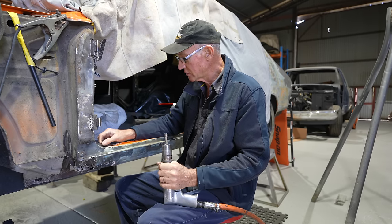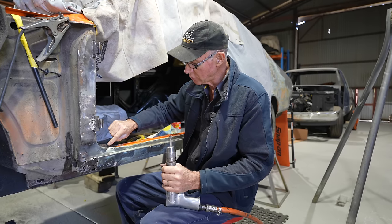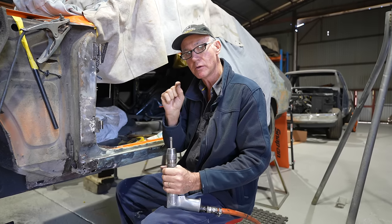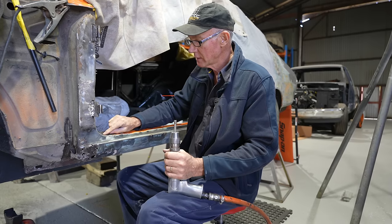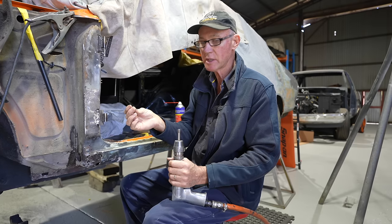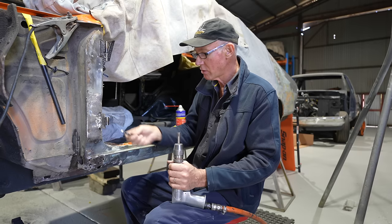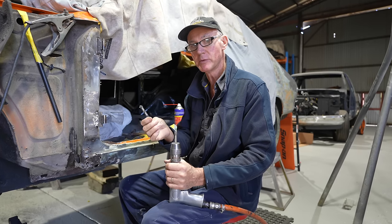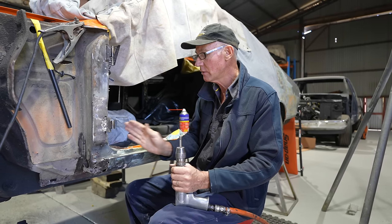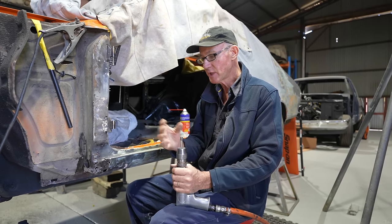But I normally like to just go pilot hole in these awkward spots. The trick to it is, centre punch it exactly right, so you cut that spot out really nice and uniformly. So number one, get a nice sharp prick punch, bang, make your mark. Grab your tiny bit for your pilot hole, go along, bang, bang, bang in your spots, and then come along, well, I like to anyway, use a drill bit. As I say, because it's an uneven surface, and these things are great, but they like a nice flat surface like I've got here. They'll cut in really nice and clean, and they'll take away everything you want.